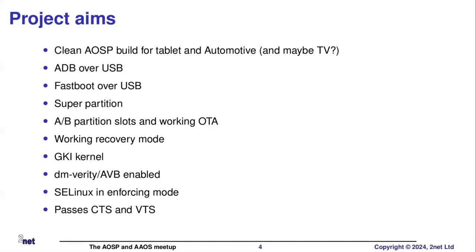Android TV would also be nice. The next point is ADB over USB. I really dislike using ADB over a network - over Ethernet or Wi-Fi - I find it rather flaky. It comes in rather late, so you could have the system booted up to a fairly large extent before you can use ADB. I much prefer USB. And also, if you have a USB connection in there, it would be nice if you could use fastboot, so I can use standard fastboot commands instead of fiddling around pulling SD cards out and reflashing them and plugging them back in again.